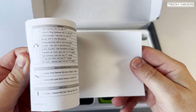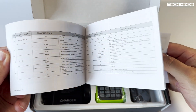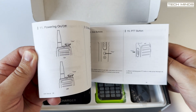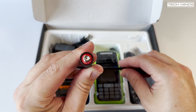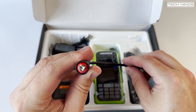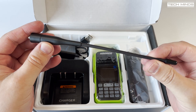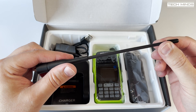The included manual appears to be quite comprehensive and fully printed in English. I also found this manual online although it was unbranded, it did appear to include everything. The antenna according to the printed specs on the bottom shows that it supports a frequency range of between 136 MHz up to 174 MHz and then 400 to 470 MHz.